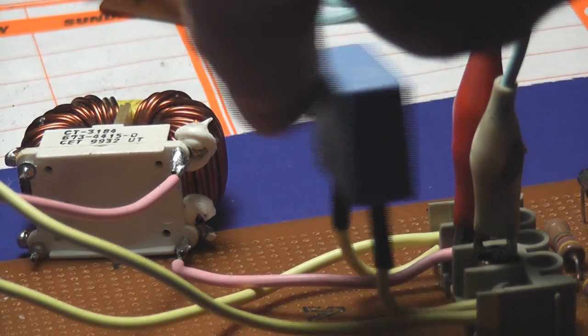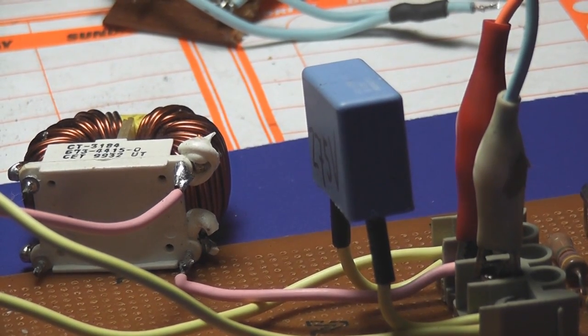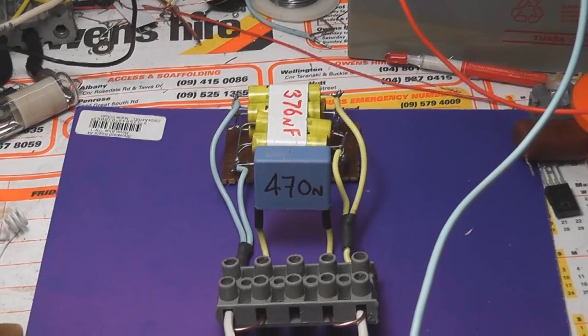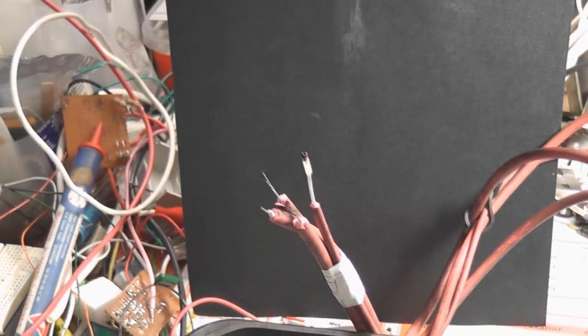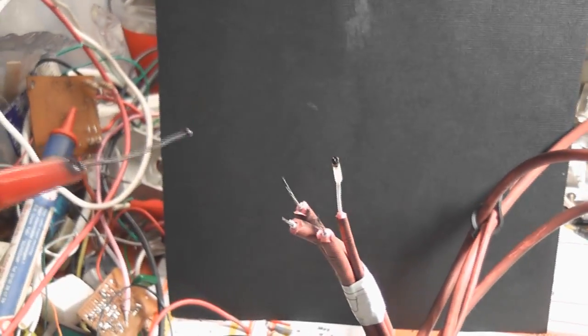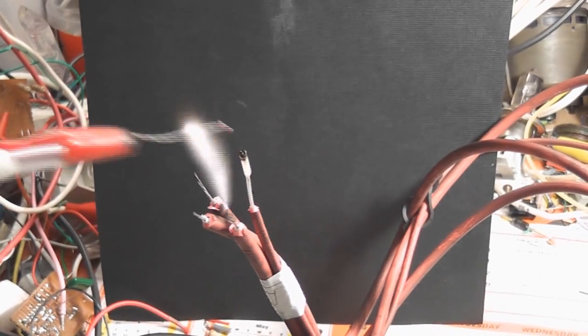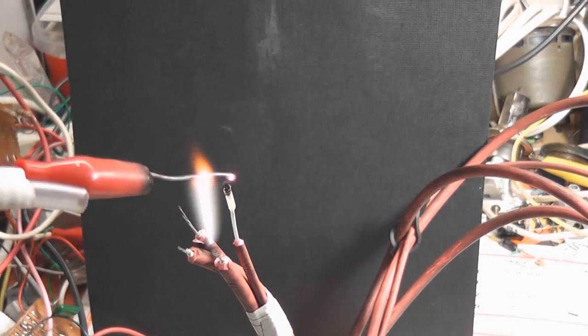The capacitor is very odd. I'm going to put the other capacitor on — I'll put the 376 by the 470, which gives me over 800 nanofarads on the oscillator circuit in the TV module. Great projection TV, and it seems to give a bit better arcs. Let's see what happens — it develops this energy. More capacitor — this gives definitely better arcs.